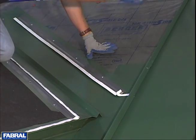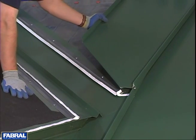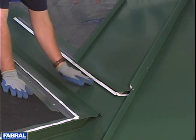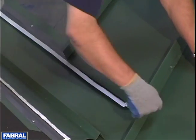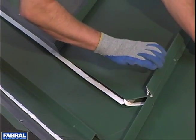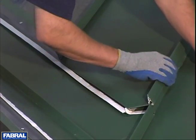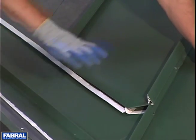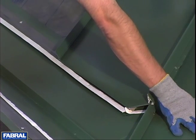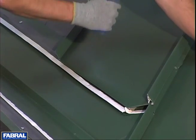How this panel gets fixed is by the upper panel. Now, notice we've got it hemmed and what you're going to do is hook it on this cleat. When we cut this part out, that allows the upper panel to snap and grab the previous panel, and it will hold this panel down. After you've got this snapped in place, fix the high side of the upper panel just like we did the previous panel. They always must be fixed at the high side.